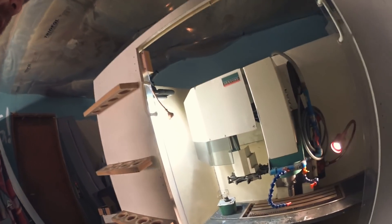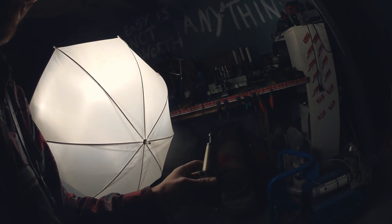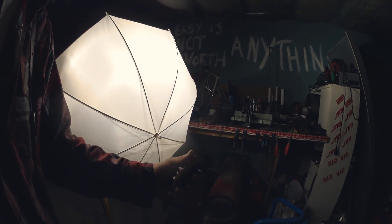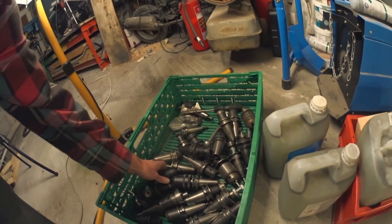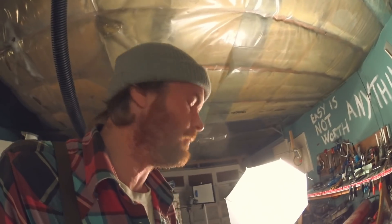I'm really happy with it and I basically knocked a third off the price because of the noise in the spindle, the motor not working, and stuff like that. And I got a bunch of tool holders - it's the BT35, which I've heard is kind of difficult to get a hold of, but at least I've got a bunch. So I just need some collets for this. There are a lot of different sizes of this style where there's a set screw that locks it in, so I should be set for a lot of machining before I have to buy new holders.